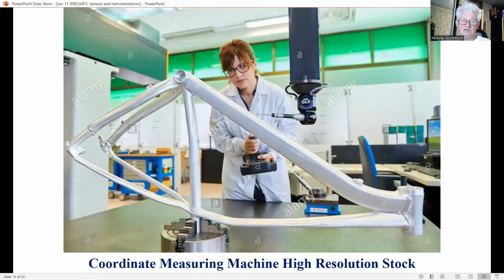In high-accuracy applications, for instance coordinate measurement machines, interferometers can be deployed to accurately measure the position of a machine part. Tatsuji et al. described a tracking system for the coordinates of a stage. It comprises a retroreflector mounted on the stage and four lasers that track the position of the retroreflector. A special algorithm has been developed to reconstruct all three coordinates. The fourth, redundant laser is used for self-calibration.